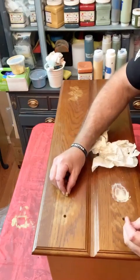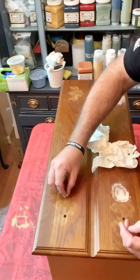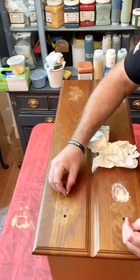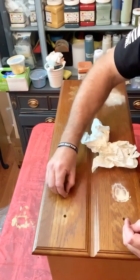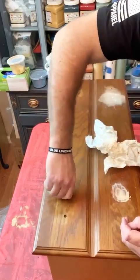I just put a little bit into the hole. Now you can squeeze into the hole if you want, but generally what happens is you squeeze too much and it drips through into your drawer. And then you have a big cleanup mess. So I just put a little bit onto the inside of the hole, and then I will put the dowel in,